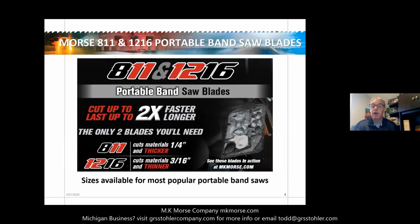The Morse 811 excels in cutting material that is 1/4 inch or thicker. So that's the one blade you would need for anything 1/4 inch or thicker. The Morse 1216, and that 811 and 1216 is basically the tooth configuration, is variable pitch. The 1216 is best for materials that are 3/16 inch and thinner. These blades are going to cut 2 times faster and last up to 2 times longer than the conventional portable bandsaw blades out there today. That even includes the M.K. Morse blades. These are outperforming those, along with the competition.